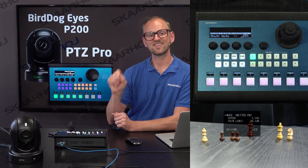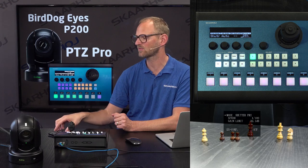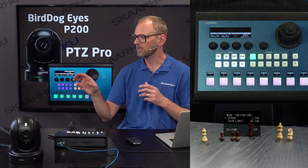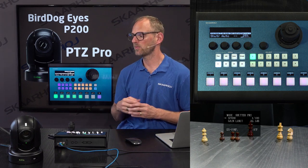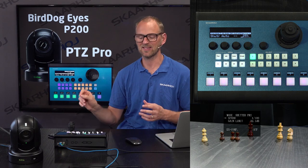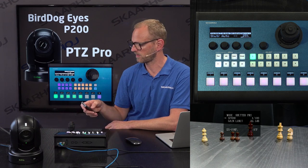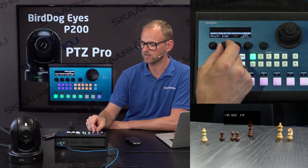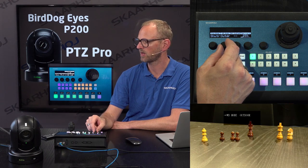This is also how far development goes, because in shutter priority mode we'd like to access the list of shutter speeds, and that would be this list that I can browse through. Implementing this list is the next thing on our development agenda — we will implement the exact shutter speeds this camera has and break them out onto the display, so you can see the speeds on the controller as well. Moving out one step and entering white balance mode, we can see white balance mode changing as I turn this dial. We are currently in auto mode, then indoor, outdoor — we have all the settings this camera offers.